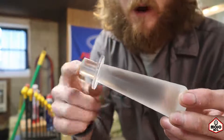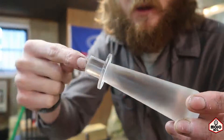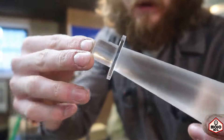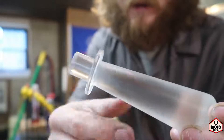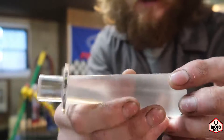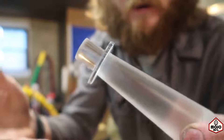A smart person probably would have drilled this side first, so I have to drill this side for a five-eighths hole right here. I should have just put the three-jaw chuck in there, drill one side, and then come over and profile it - that would have been a lot easier. But oh well, we just have to make soft jaws now.